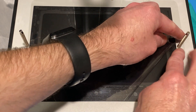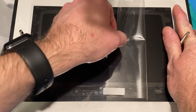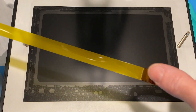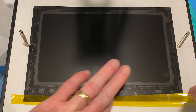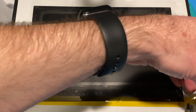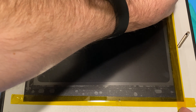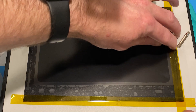You see I started to peel that corner up — that's what we don't want to do. Having waited longer would help with that. Now I'm not touching the screen, I'm touching just the edges to make sure it doesn't come up. Now the tape comes into play. This will just help seal this edge and help hold it down for two reasons: one, it will help hold the whole thing in place and keep it from moving; two, it will also provide a seal around this edge in case you get resin spilled here — it won't come under the edge of your screen protector. I'm going to apply two pieces here, one on this edge on the inside of this screw, just to get that seal inside there where it's most likely to go, and one on the outside edge.